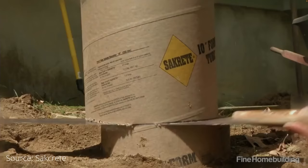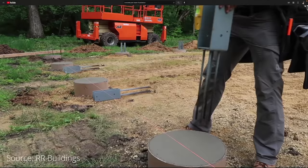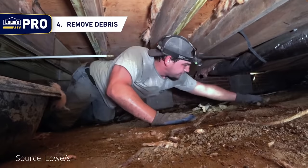This helps ensure that the piers won't shift. Circular rebar cages are placed in the middle of the voids. These tubes must be perfectly straight and level. Next, the voids are filled with concrete and a base connection is embedded in the top of the pier. Beams are extended from one pier to another. These will support the joists and the flooring of the home. Usually, the crawl space underneath the beams is about 18 inches from the ground.